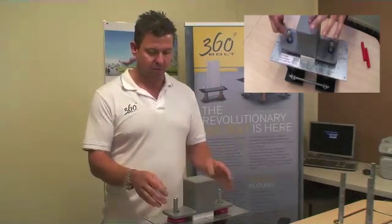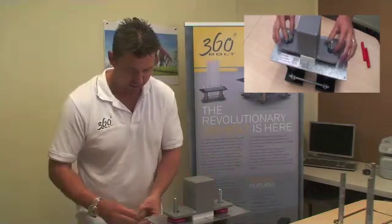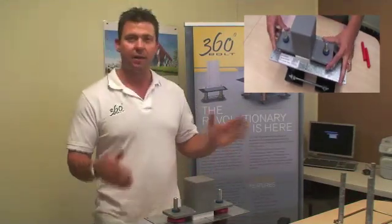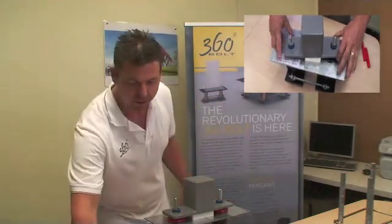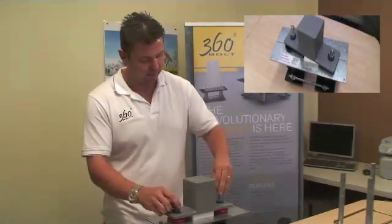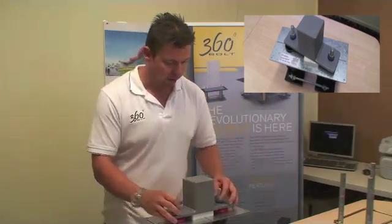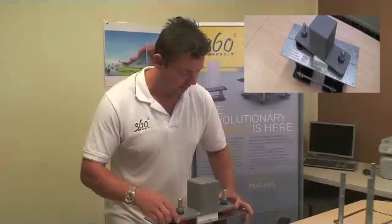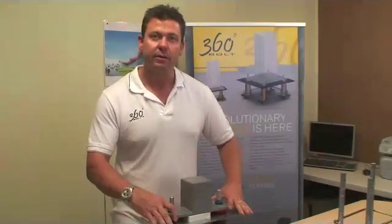At this point it's still the same as a traditional setup — the bolts are in the right spot but we need to confirm they're located correctly. We then put on our special spherical washers, which allow the bolt to move over the base plate while still directing the load straight down into the base plate without loss of surface area. We fasten the bolts down so the column is safe, check our lines, and if the column needs to move, we can shift it 30mm in any direction or angle it as needed.